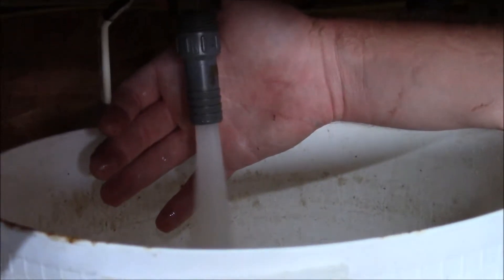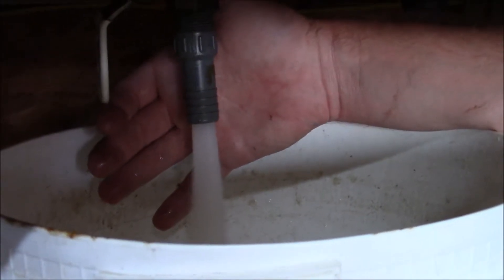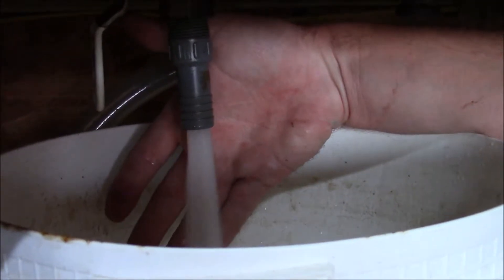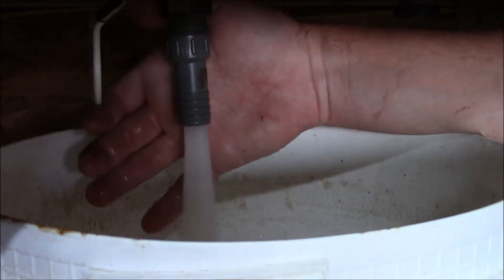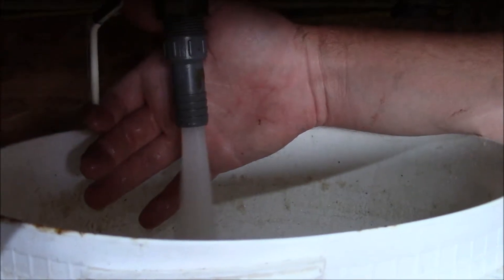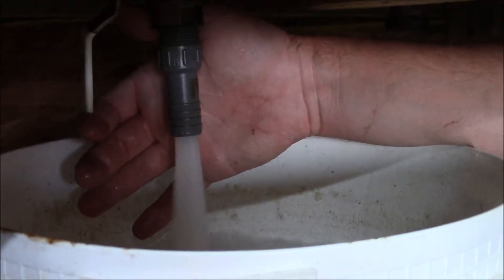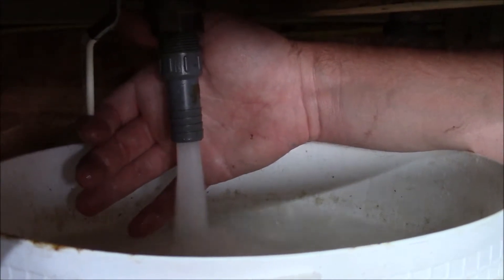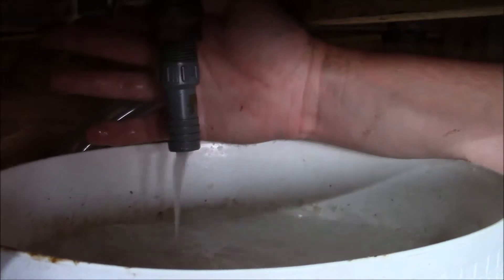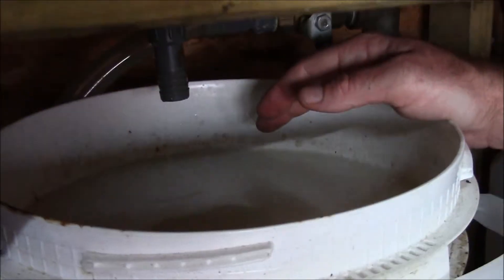We may have to go through five wash cycles, sometimes six — it all depends. I typically look at the color of the wash water coming out. When it gets pretty clear, definitely not as clear as tap water, but if there's just nothing more than a little haze, I'll usually go ahead and perform the 50-50 shake test, which I'll demonstrate here in a little bit.